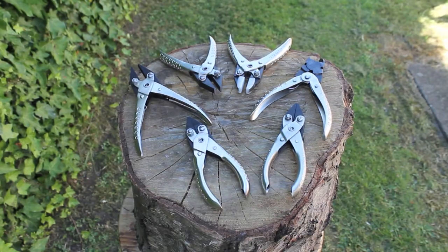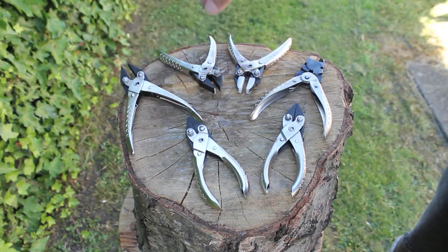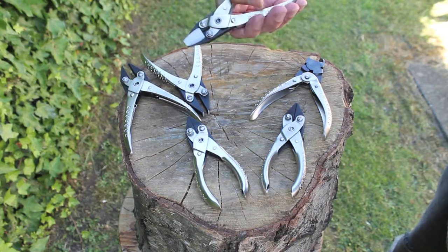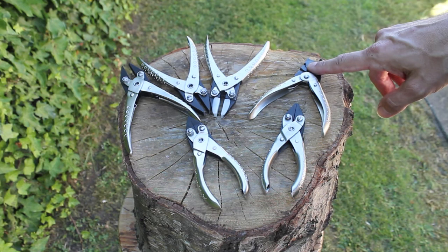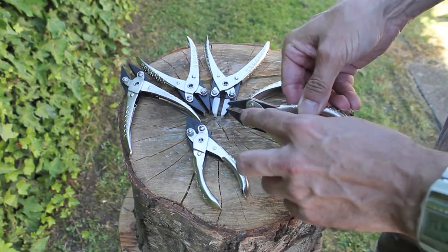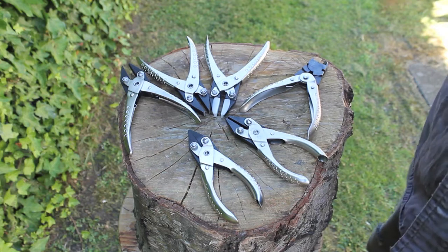So, just a quick run round all of them. 140mm ring nose pliers — one side flat, one side half round, spring loaded. 140mm spring loaded flat nose pliers — these are going to be your everyday ones. 140mm double spring loaded flat pliers with nylon inserts. Your 140mm spring loaded wire cutters. And then the two smaller ones: the 12cm with the serrated jaws and the grooved ones — great for wire — and the 12cm ones with the snipe nose fine tips. Six pairs of pliers in your funky plastic wallet.